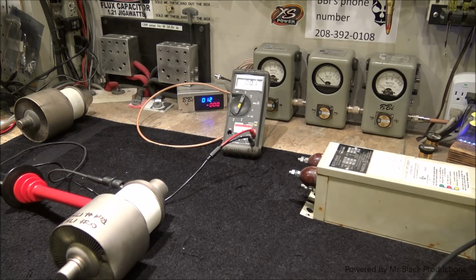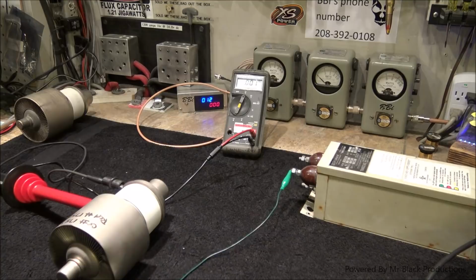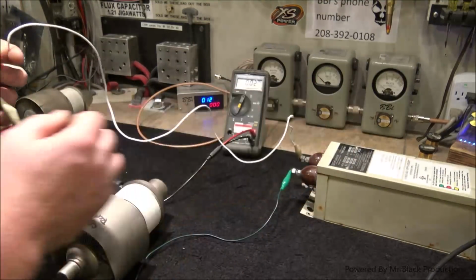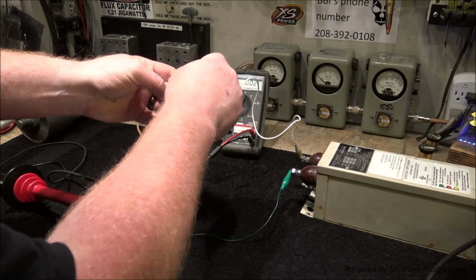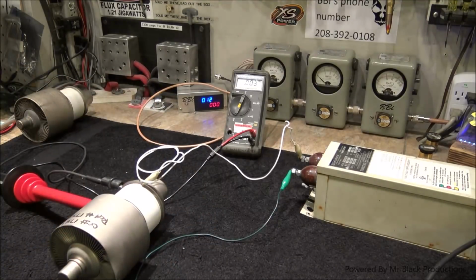The reason we're testing it underneath low voltage and we're not dropping it in an amp and running right away with it is because, well, I don't feel like tearing up something I spent a lot of time building. I just don't. So a couple little small preliminary external tests like this gives you a window of what's going on internally with the tube. Me personally, since the filament is so far out of spec on this particular tube, I wouldn't even bother running this thing to see what it does for emissions, which is a whole nother thing.